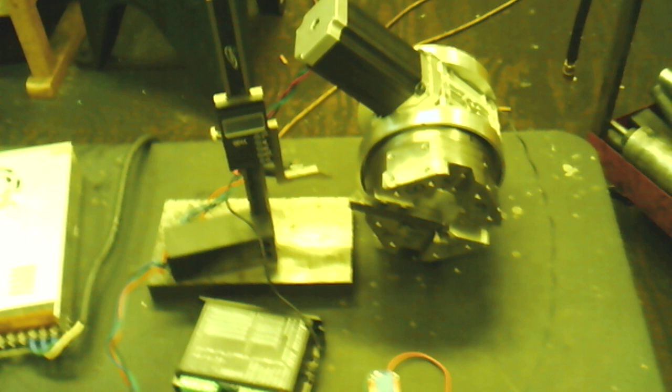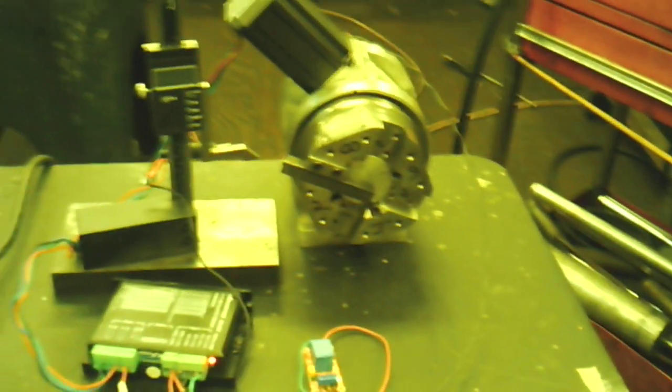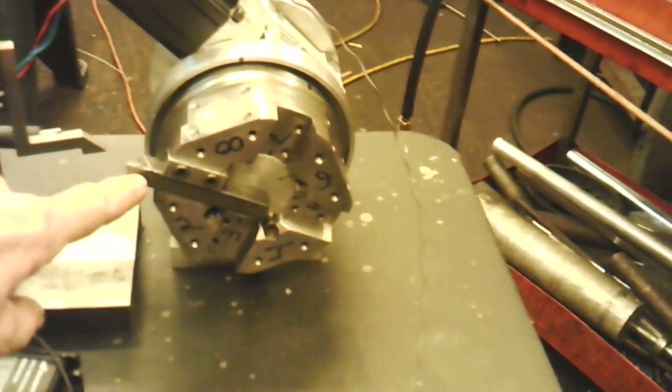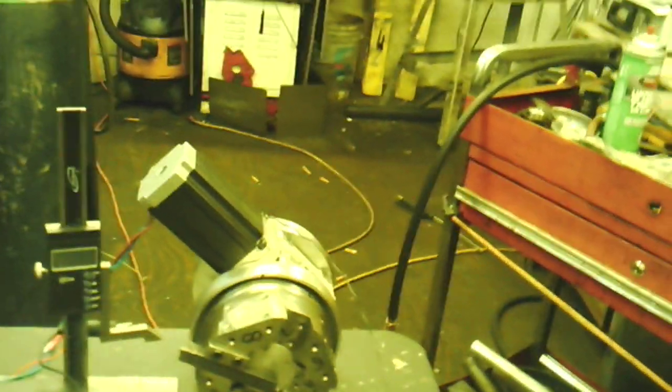So now the Arduino software, a guy is helping me write that Arduino software so that instead of my tool positions being in 45-degree increments, because the tool heights are different between tools where the actual cutting edge is, I'm going to set tool heights with the gauge instead of just saying 45, 90, 270 or whatever. I'll rotate it, it'll set it, and no matter where it is on that 360-degree circle, it'll save it as that tool number, if that makes any sense.